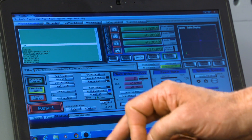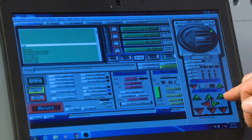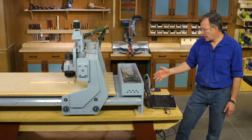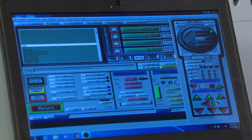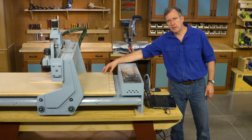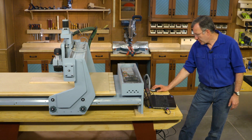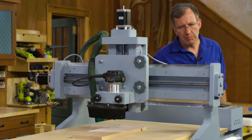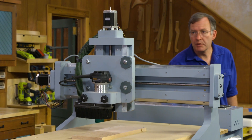I'll hit the tab, and you can see this box on the right with push buttons for Z, X, and Y. This is how we actually start to move our machine. When I press positive X, the machine moves in a positive X direction relative to an origin point. When I press negative X, it returns. When I press positive Y, my router moves in that positive direction, and when I hit negative Y, it returns. The same applies to the Z — positive Z and negative Z.